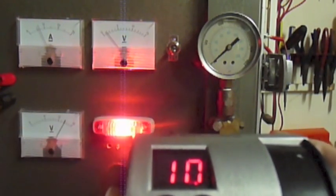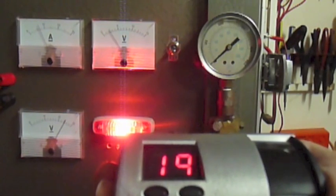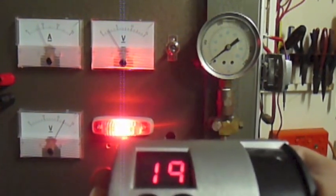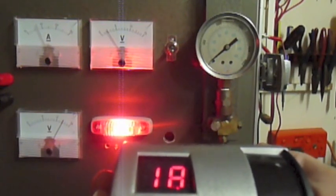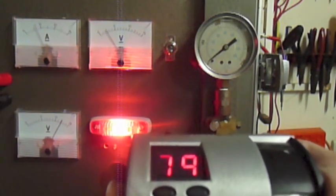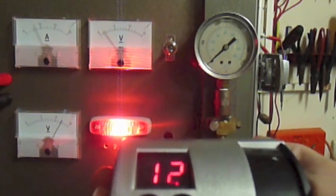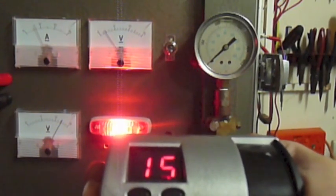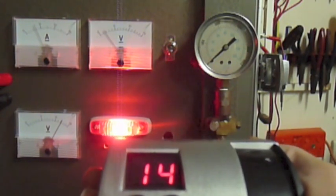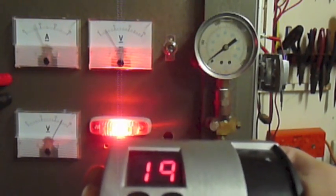We're using a Hayes Genesis in-cab controller here that we are the Australian importers of. And this is a very solid unit. This one unit is adjusted for hydraulic operation, not electric brake operation. And we do that to get rid of any signal that we have coming down when we've got electric brake operation. So this is designed, and the one that you buy, you can adjust it to either 2 modes, electric or hydraulic. Make sure that you do set it up for hydraulics.